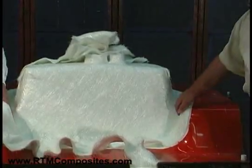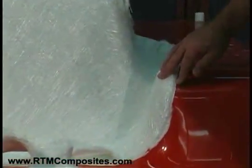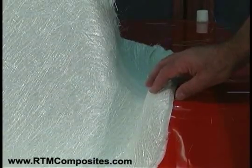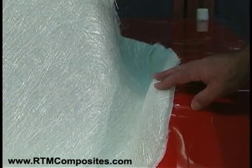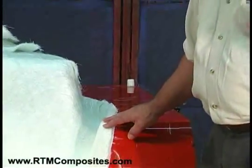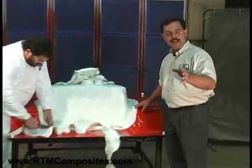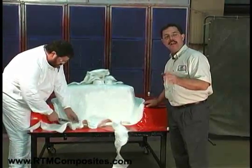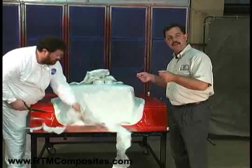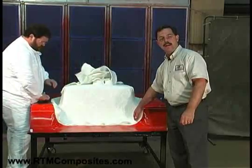You can see that Don is trimming the glass to the edge of that gel coat he had applied earlier. While that extends just beyond the edge of part — generally about three-quarters of an inch — there are times we can mold to net shape, but most commonly, in fact 99% of the time, we're molding out beyond the edge of part, expecting that once finished the part will be trimmed precisely to the edge of part's design.